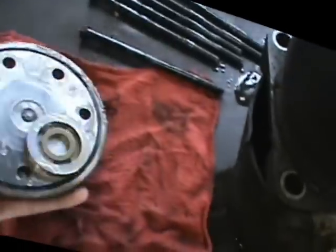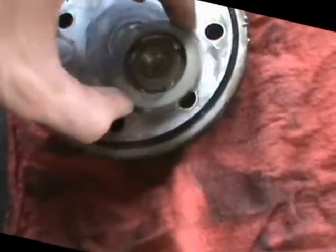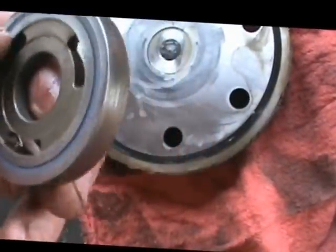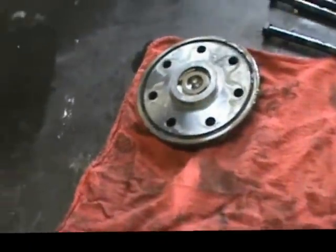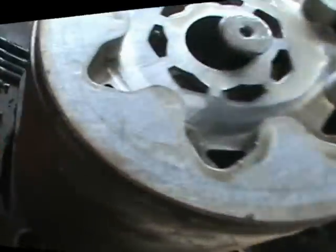Take the first cap off. Make sure you keep all these in order because when you get them out of order they don't work. Your commutator ring is right inside here on the other side — see that? There's actually a little tiny piece of nylon in there called a commutator seal or commutator ring. This is what I was talking about — these plates can get out of alignment, which is why you could rotate this a crazy degree and it'd be off.